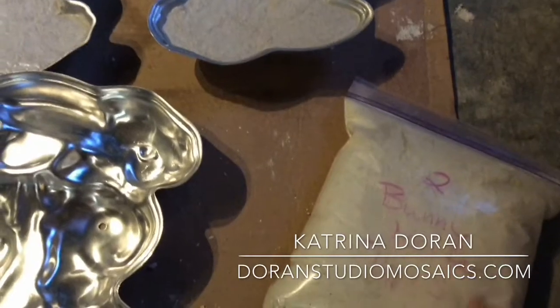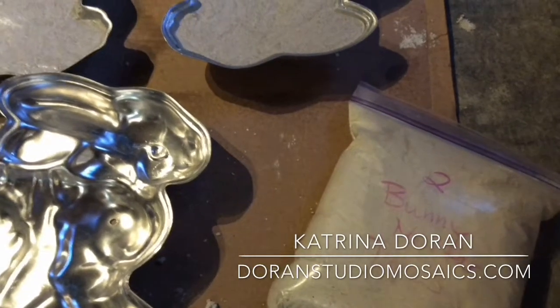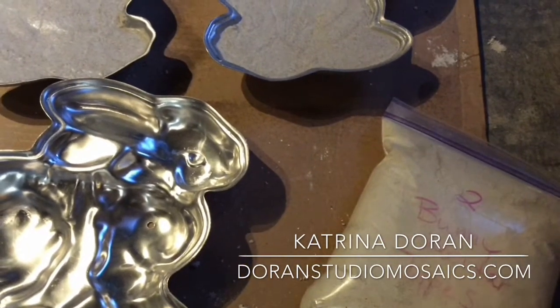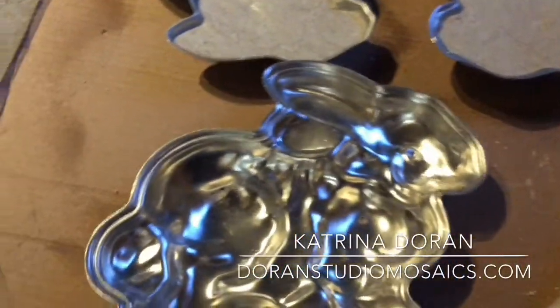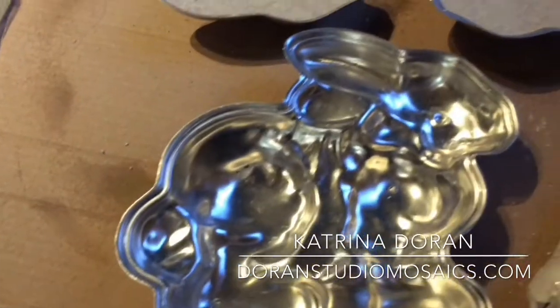Out of a larger bag I mix it into smaller bags for storage. I mix this with water and a polymer additive to make the mortar mix more elastic and durable, because parts of the mold will be kind of thin, like where the ears are, and I want it to have a little bit more strength.